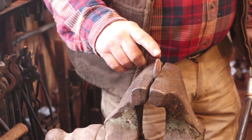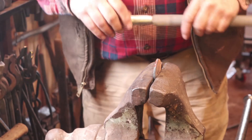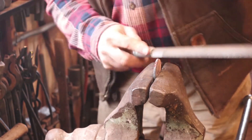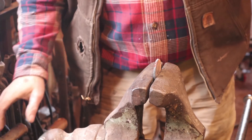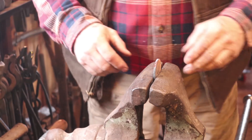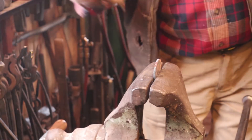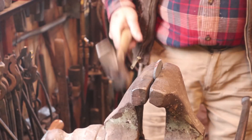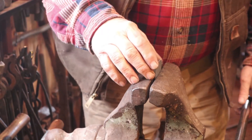I'm going to do two things to test this. First, see if I can file it — if it doesn't file, it's hard. That files very easy, files like annealed mild steel, really. So definitely it's not hard. The other thing I'm going to do is see if it'll bend. And yes it will, with a two pound hammer. So it's definitely not hard.